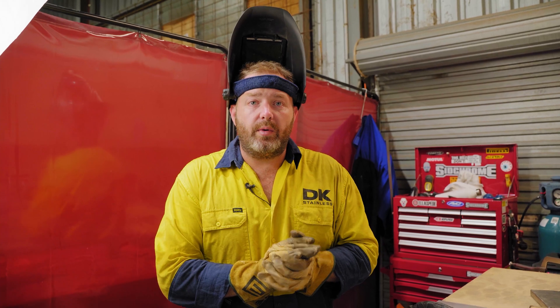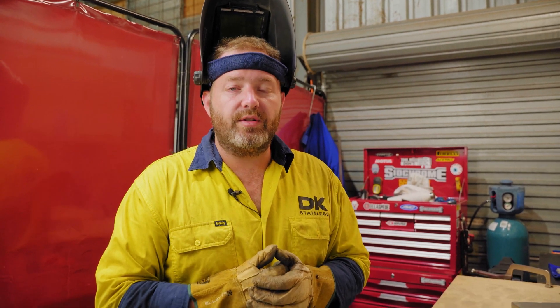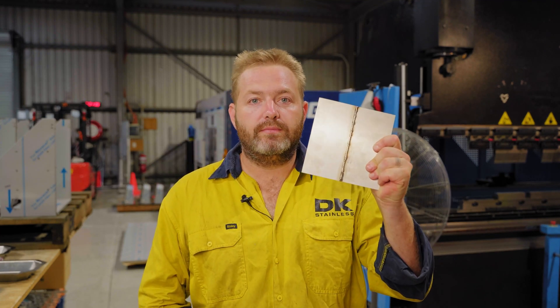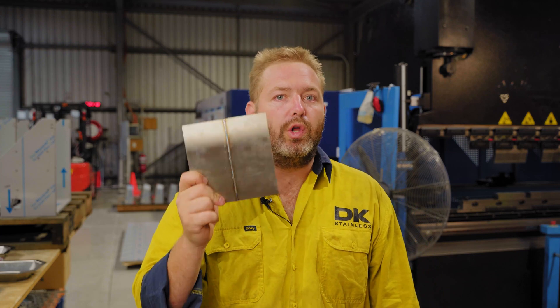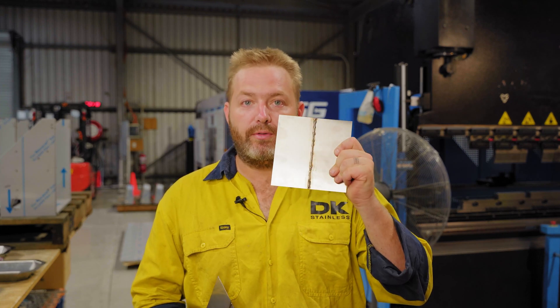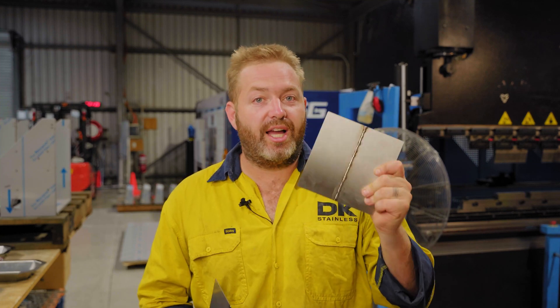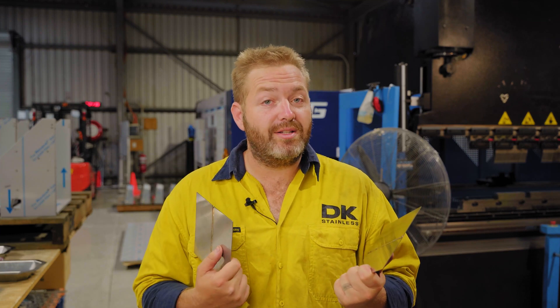Stay tuned guys. The next video, I'm going to show you how to dress the fused weld and completely polish it to a number four finish. And there you have it — fusing both sides of stainless, and using filler wire. The advantage of fusing both sides is it's still strong but creates a lot less heat, therefore a lot less distortion. The advantage of using filler wire is you can go way up in material thickness, and sometimes you just can't get to the back or other side of the stainless to weld — so that's where you use that method. Next week I'll show you how to dress both of these up, then go through the whole polishing process to a number four finish.